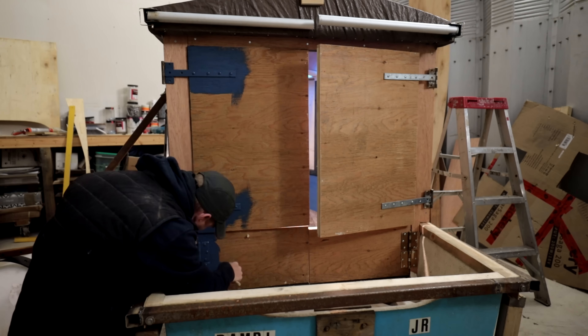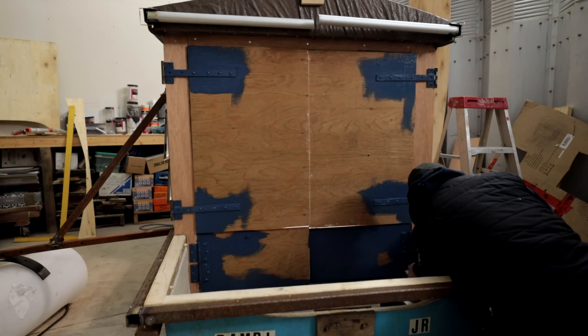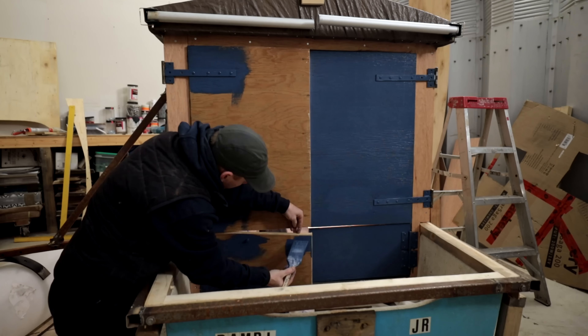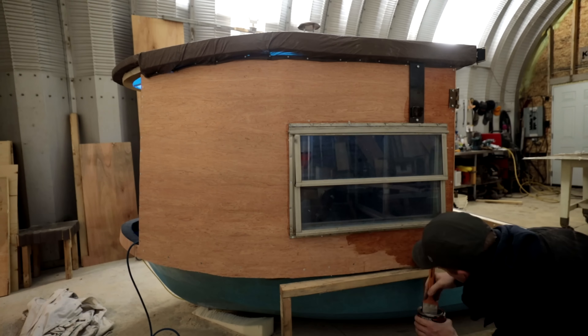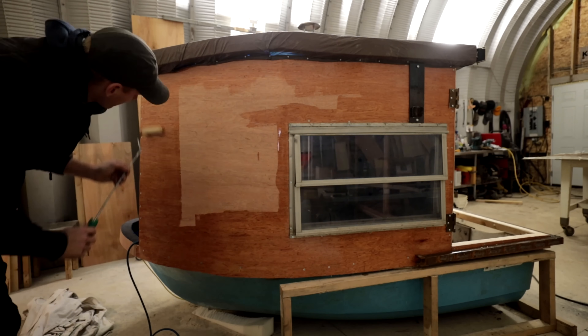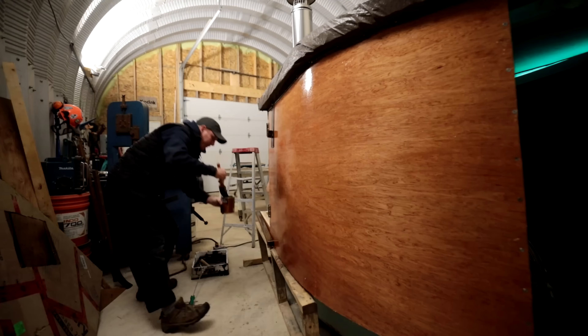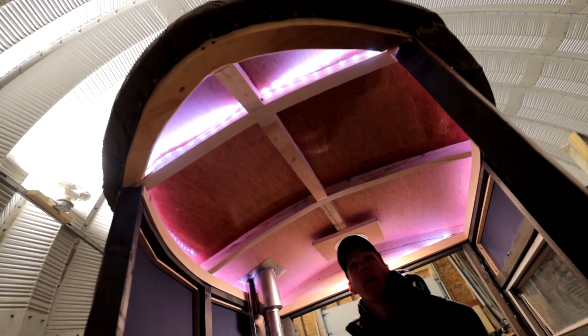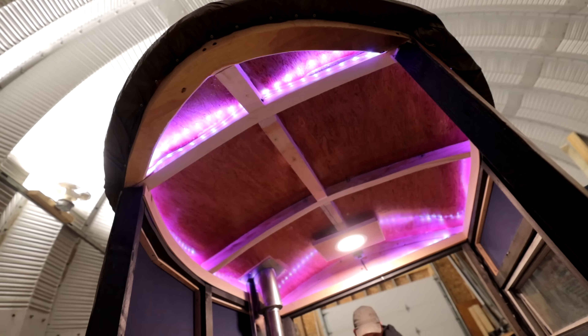At the end of the day, I'm giving this thing its proper paint job. I started with the back doors — painted them a nice blue color like the inside. The plywood wasn't the greatest looking so I freshened it up, evenly coated it, and coated the hinges as well. Then I applied a coat of marine varnish on the outside to bring out the grain in the wood. I cut in the edges with a brush, rolled with a microfiber roller, then evened out the roller marks. When dry, I'll lightly sand and apply another couple of coats to make sure it stands the test of time.